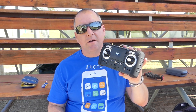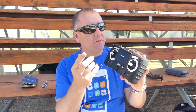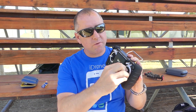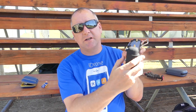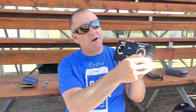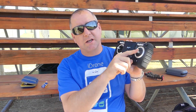A couple of other things: this remote control comes with these little rubber things on the sticks. I left them on, but these things actually limit the amount of range you get on the way you pull the sticks around. So you actually need to take them off the left and right sticks, because otherwise you don't get the full range and that can be problematic. Also, when you arm it, you pull the sticks down and out — I wasn't able to arm it because I hadn't calibrated the sticks yet. They were physically going all the way down, but calibration wasn't seeing it as 100%, it was showing 80%, so it wouldn't arm. Once I calibrated the sticks, there was no problem. There are instructions in the manual on how to calibrate, and the instruction manual is actually pretty good — it covers a lot of stuff like that.